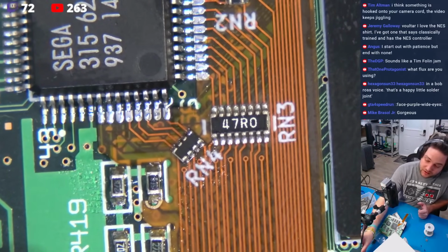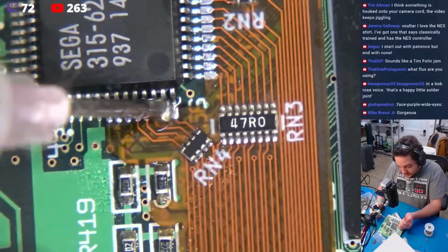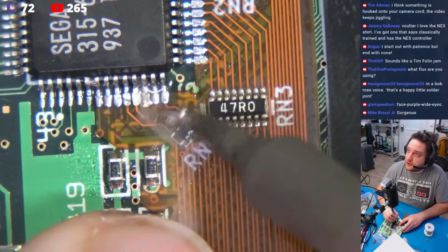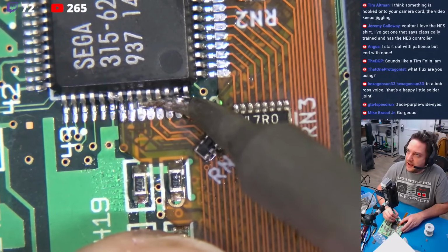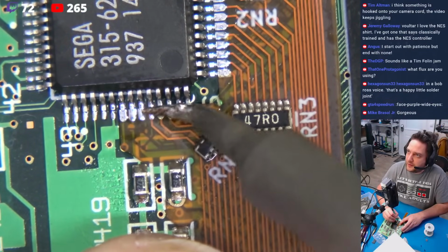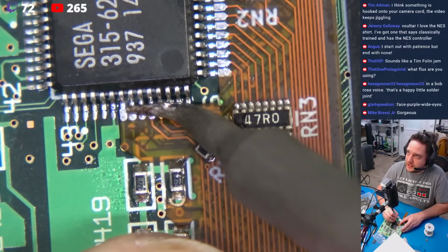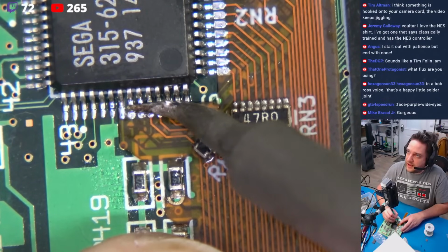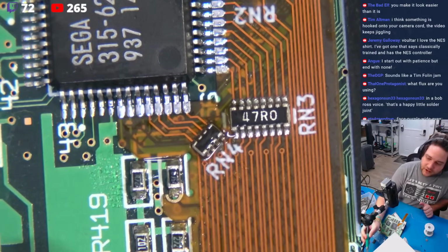There's nothing to this. Again, you can see people come in here, and you can see them try to, like they're painting by goddamn numbers. We've talked about this. Oh, I just got to get this perfect. Oh, it's just never going to be right unless I get the solder perfectly over these fillets. That's not how solder works. And that becomes more of an art than it serves any really functional utility. Just watch. Sweep across. Nice and easy. Just like that. That's all it takes.